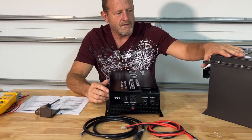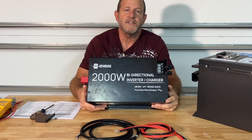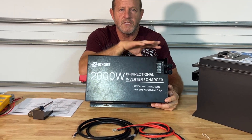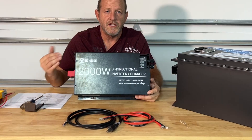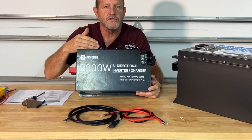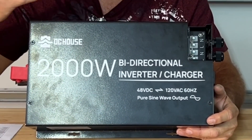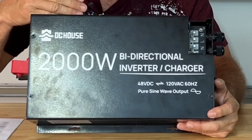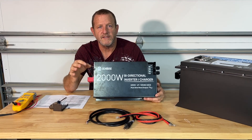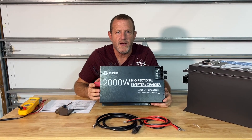It's going to work perfect. This works with lithium iron phosphate batteries. It has over voltage protection and under voltage protection — so if your batteries drop below 45 volts, it will shut down. Once it recharges back up to 52 volts, it will turn back on and the inverter will start operating normally. It's a pure sine wave inverter, so it's safe to use on inductive loads like motors and sensitive electronic equipment. It is a 2,000 watt inverter, but it does have a 4,000 watt surge capacity. It's 60 hertz, so it is suitable for the US market.